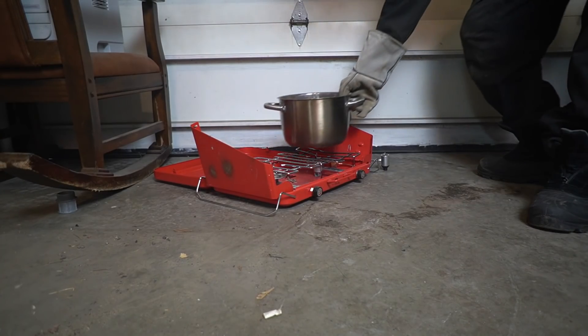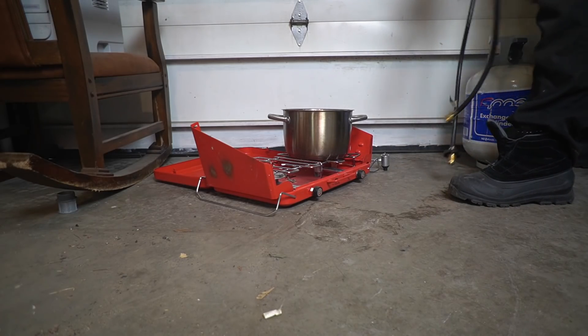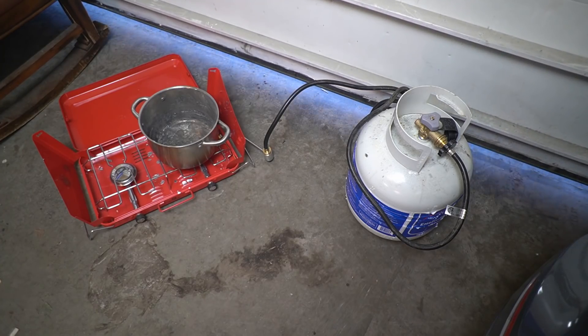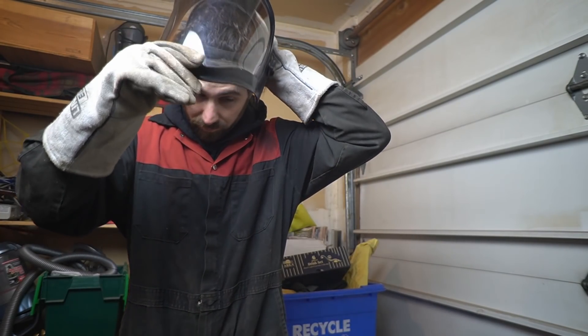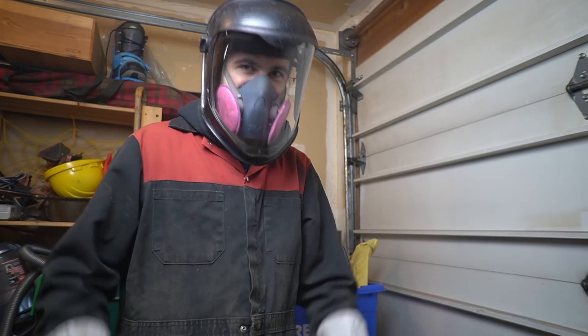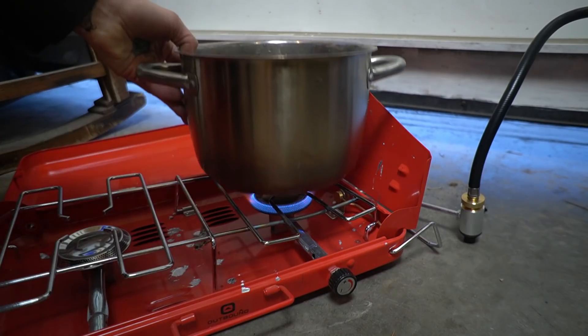You're going to like this. With a pretty simple setup, we can melt these down and pour them into clean lead ingots. Just a camp stove, stainless steel pot, and a bottle of propane. It should be done outside, but the cold weather will make it take a lot longer, so we're just going to crack the door open a little and keep the fan going. Lead is toxic, so gloves and goggles are a must, or at least a splatter shield, as is one of these particulate filter masks. Lead fumes aren't really likely — it's the lead dust we're trying to protect ourselves from.